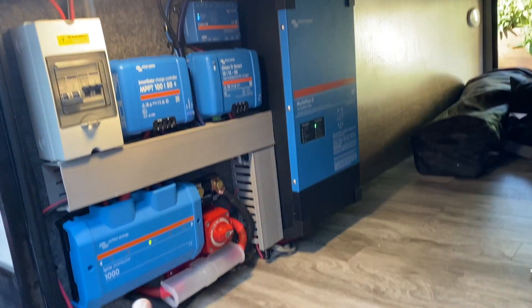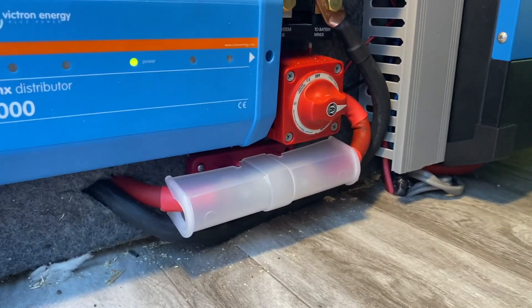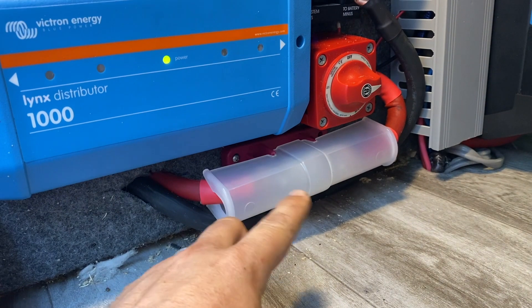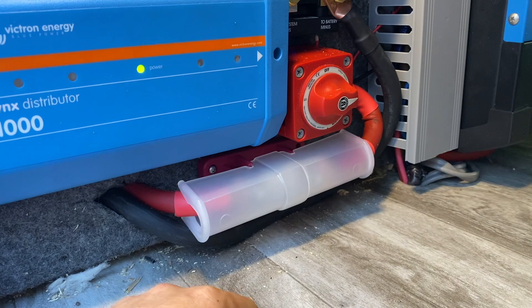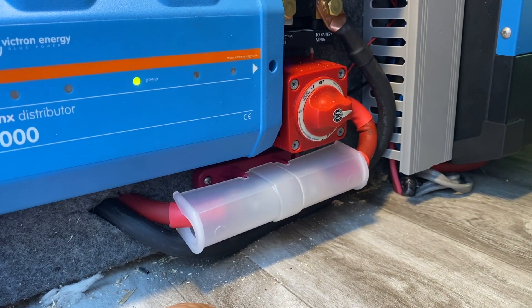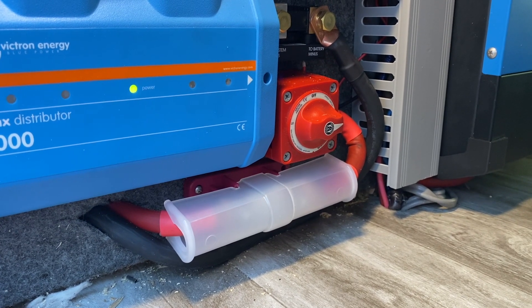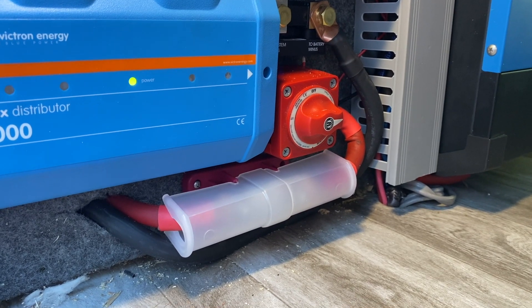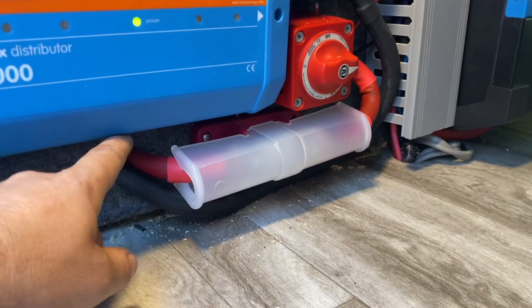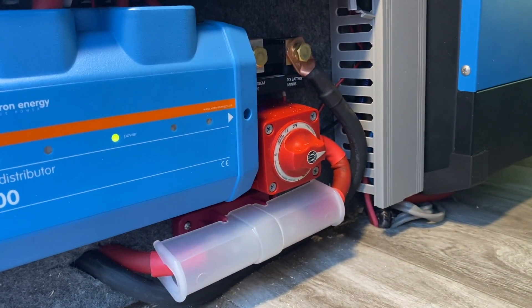We load tested all this — it runs the air conditioner just fine. Keep in mind that when running heavy loads the fuse area will get hot because it's just a thin piece of metal whose job is to blow at a certain temperature. It doesn't go from ambient temperature to exploding in an instant — it gradually goes up there. That's one of the reasons why I like using 4/0 cable on all this stuff for 12 volt — it just makes sense.